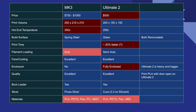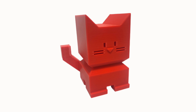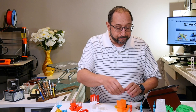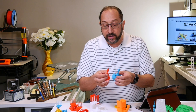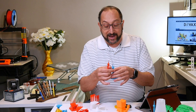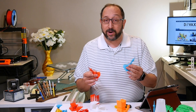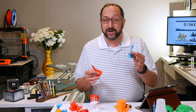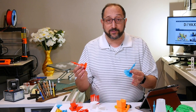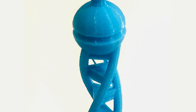Let's look at print quality. I've done a lot of prints here — 2x size calibration prints where you can't tell the difference between the two; they're both outstanding. I also printed Polymaker towers which are really similar, very good. There is one difference I attribute to the slicer: a slight seam on the print from the Ultimate II using Cura version 3.3. I haven't tried creating a profile in the most current Cura for the Ultimate II — I wanted to use the software that came with each printer. Overall these prints are identical; in fact, both have a slight problem at the completely horizontal overhang with a little bit of drooping underneath.